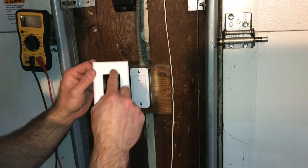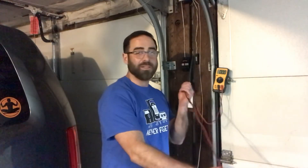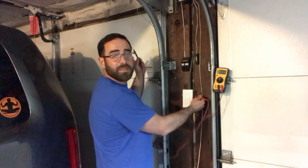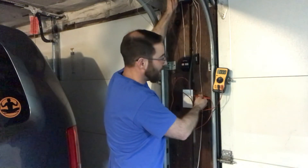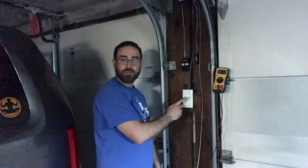This particular model doesn't even have screws on it - it snaps right in place. The switch is installed and I installed the software for it. That'll be different for each switch, so follow whatever the manufacturer recommends. Since I had to connect the neutral wire to the actual case, I want to make sure there's not 120 volts running through it. I'm going to take my voltmeter, touch it to the box, and find a suitable ground - I have another switch on a completely different circuit up here. I don't see any voltage on anything attached to ground, so I'm comfortable touching this. The switch works manually and on the app.